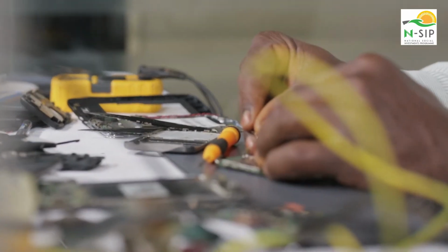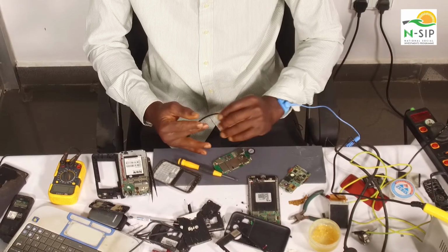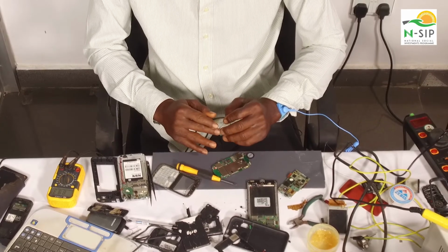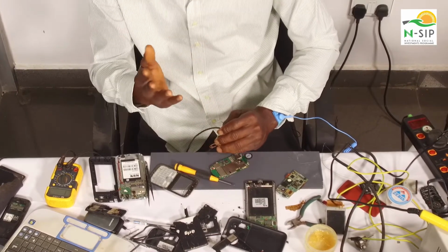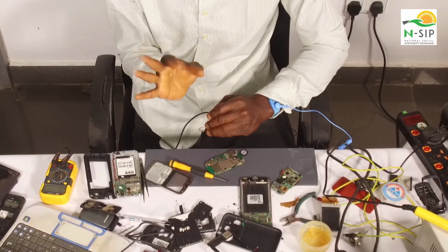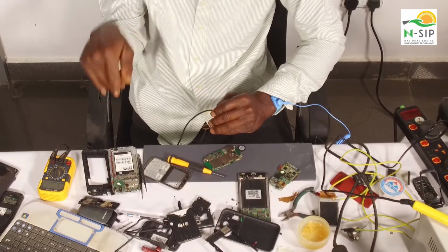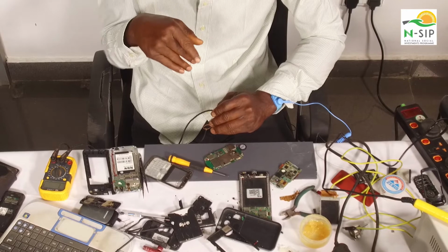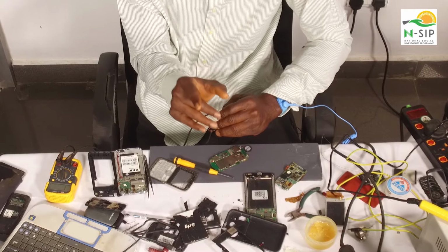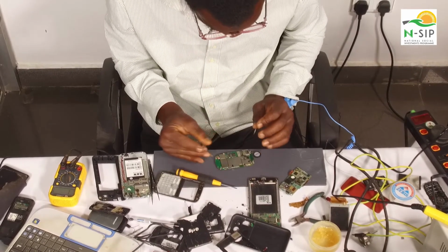In this case, I'm having a switch of two legs, which means that one will be positive and the other will be negative. If I'm having a 4-leg switch, in some instances, we have two types of that. Some will have the positive terminals up and negative terminals up, one will lead into the other. And some will have the positive and negative terminals at the back, which means that the two other ones at the front are just to stabilize the switch. So in this case, I'm having a 2-terminal switch.